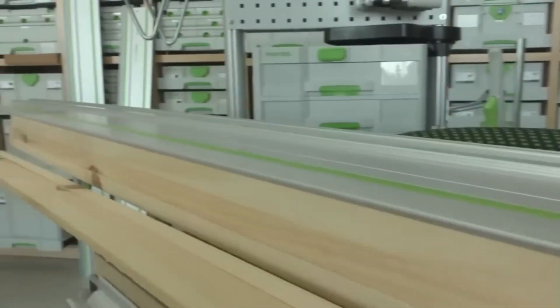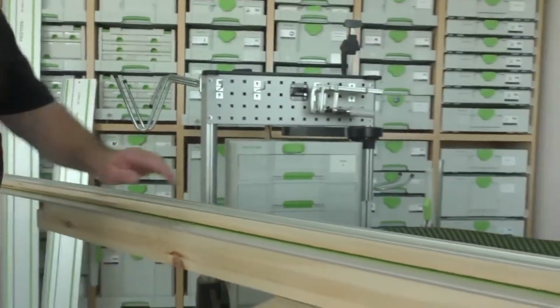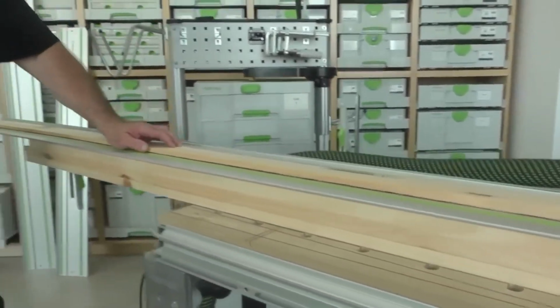But if you look at that, and I know people who do this all the time, they make 2 or 3 cuts with a 75. They don't have to. They can make 1 cut and check it out. That's a full depth of cut, maybe 1 or 2 saw marks where I stopped or hesitated, but that's it. So what that equates to is a huge time savings. Think about if you're ripping, say this was cherry or maple, and you're hesitating or struggling with a saw. There was no struggle here whatsoever.